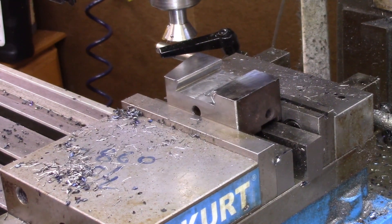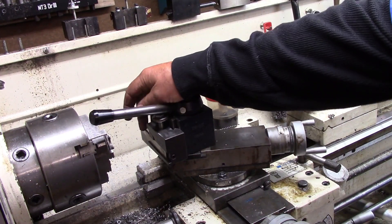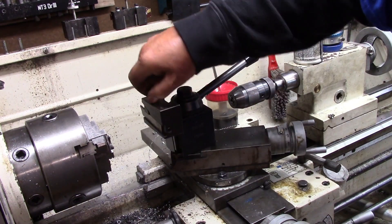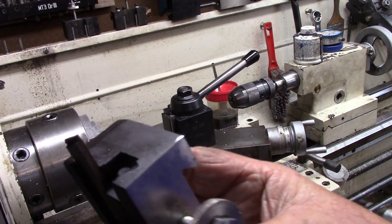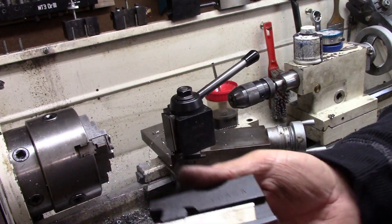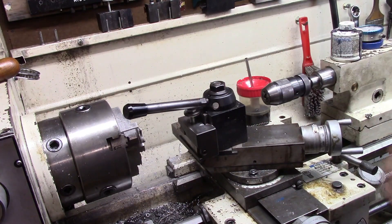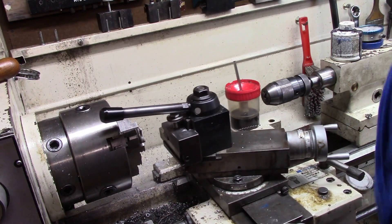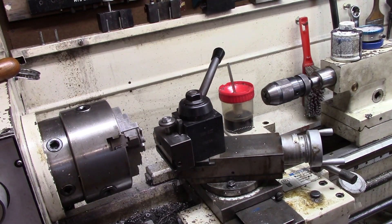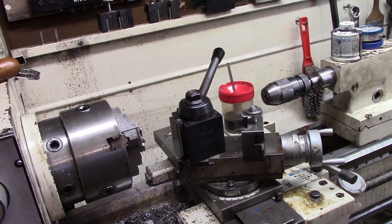Got a splinter right in my finger, folks. Now let's go to the lathe and see if it locks up. That's a little looser than I like but I'm not going to re-weld it. I've also decided I'm going to keep this holder, and I'll show you why. Somebody has taken this thing and used these cutoff tools and ground them into little grooving tools. I never thought of that — that would be perfect instead of using high-speed steel for little grooving jobs. So I'm going to keep the holder just to do that with it. I'll just get a couple extra cutoff blades and grind them into grooving tools.